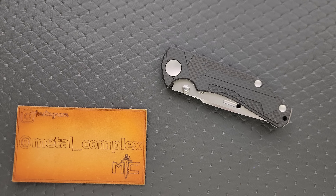But at 67 Rockwell, ZDP-189, while certainly nowhere near the toughest steel out there, is substantially tougher than something like M390. So you get unbelievable levels of edge retention, especially when you couple the fact that the edge has been convex ground with a zero edge on it. That's why they're able to boast such incredible levels of performance — this thing will literally outperform pretty much anything on the market and will do it without breaking a sweat.